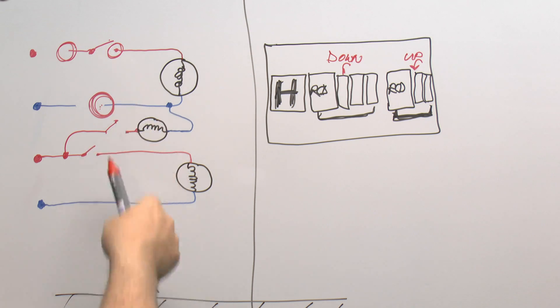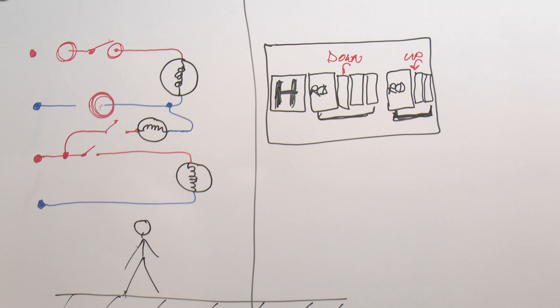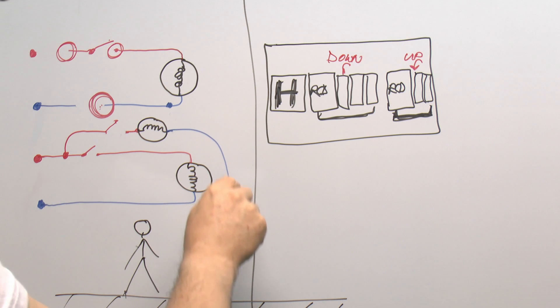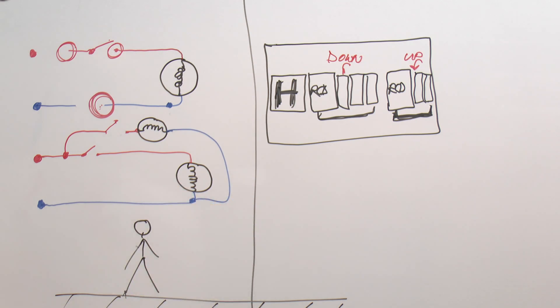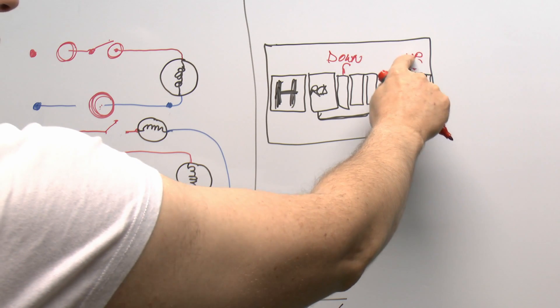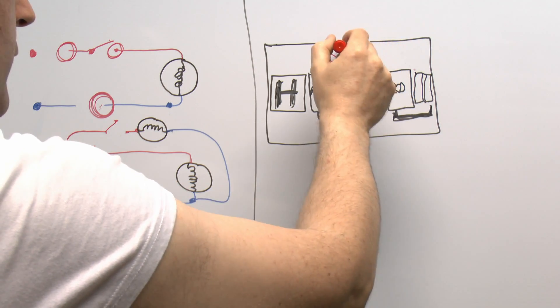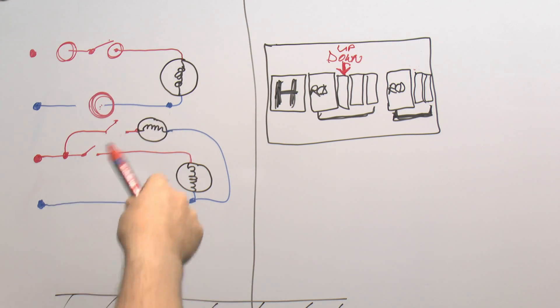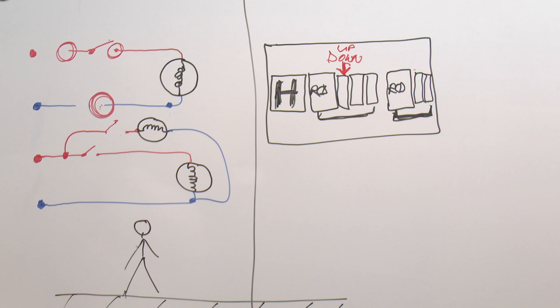The way to avoid this is to test the installation before fitting a new consumer unit, so you can identify the problem. The ideal fix is to remove the cross-neutral link and reconnect it to the correct circuit — in this case the downstairs one. Unfortunately in a house that usually means cutting out walls and lifting floorboards, so quite a lot of extra work. The other option, which is done quite often, is to put both upstairs and downstairs lighting circuits onto the same circuit breaker, making the whole lot effectively a single circuit and thereby avoiding the RCD tripping. That's not ideal, but it avoids digging up floors and chasing out walls.